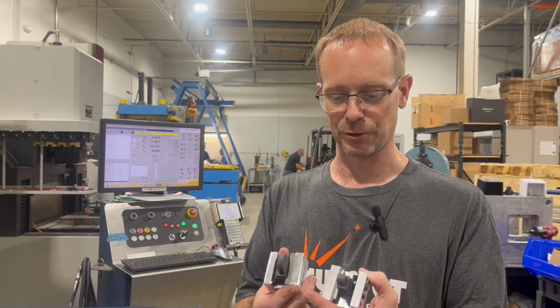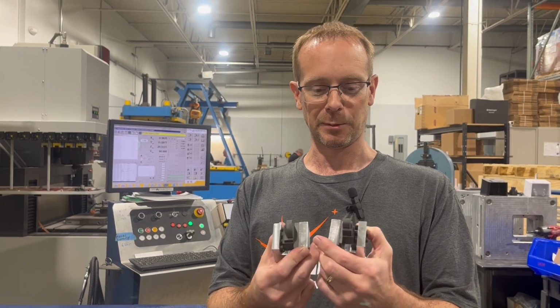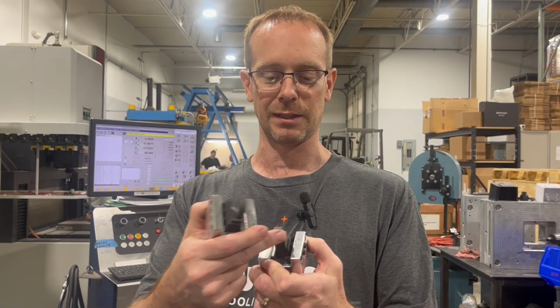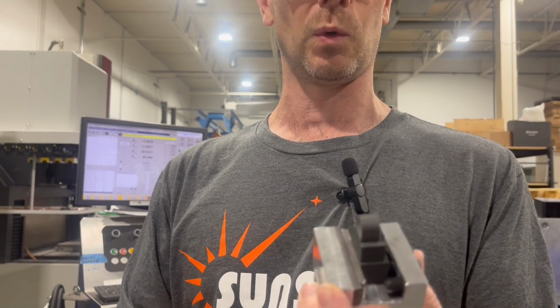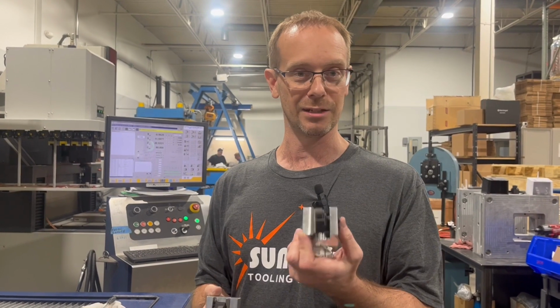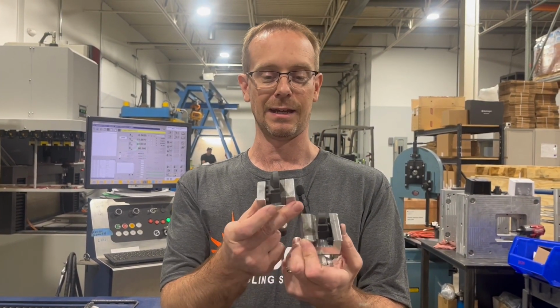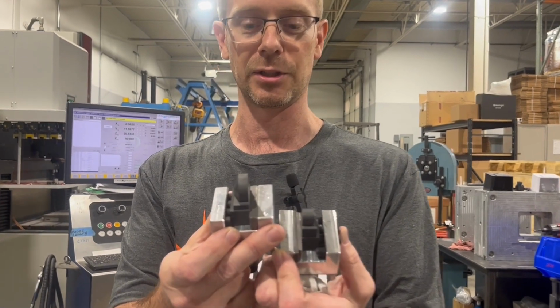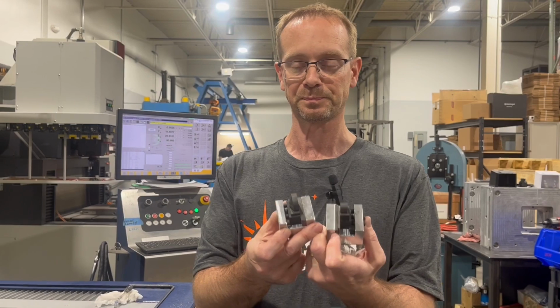I wanted to cover a couple things about burning electrodes like we were doing. Murphy brought up a good question: why couldn't we take this electrode and double end it, so we could rotate it and have 2 electrodes in one? That's a very good point. You can do that. We didn't do that in this particular situation, but it can be done, and you could have done it on this one as well, just making the same thing on the other side, making 2 electrodes in one.